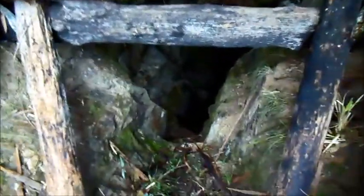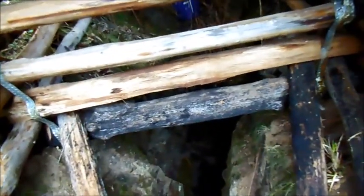And as I said before, I'm going to put a stull in, put a little platform in just down there somewhere where my finger is, and then attach the bottom of the ladder to the base of the platform securely, probably with metal strapping, because that's going to be the strongest method, and notch it in as well.